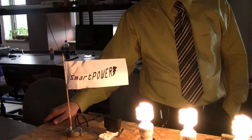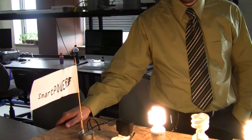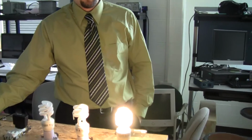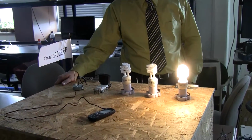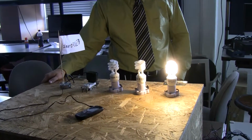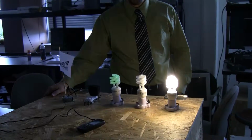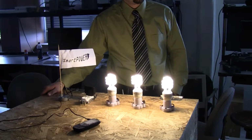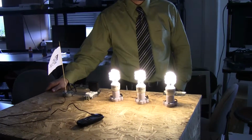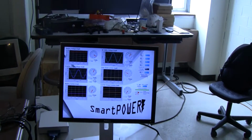So like you are pressing the button, the flag will be turned on? Yeah, but also it can change depending on, say, the capacity remaining in the battery. Say, if the capacity is real low, none of the loads except load A will be on. So that's load A. That will always run until basically the batteries are fully discharged. But as the capacity goes down, other loads will turn on. And this is pretty much a simulation, because in the time we had using these loads, we couldn't discharge the batteries fully, so we have to simulate the discharge using this capacity usage slider.